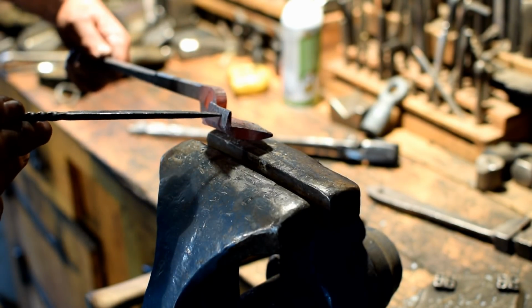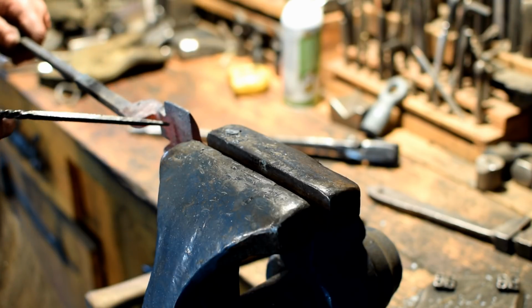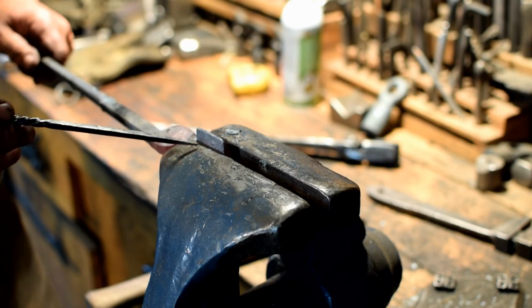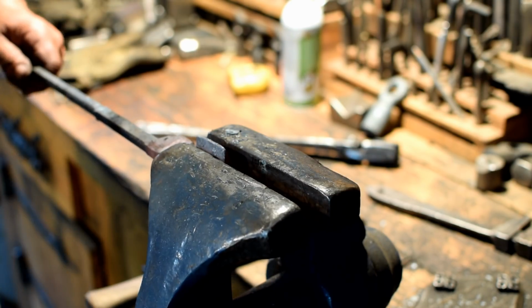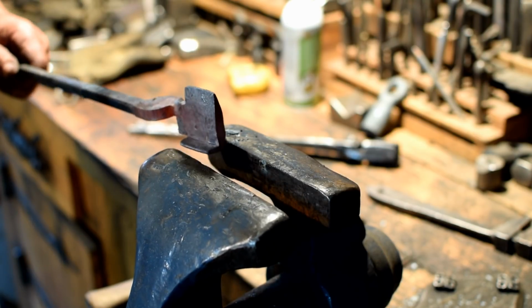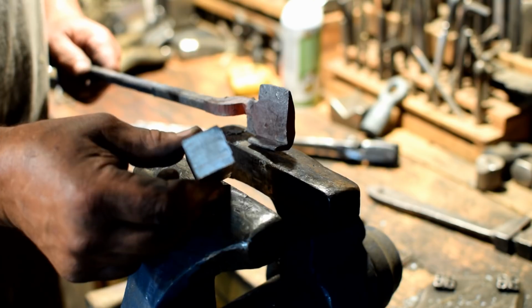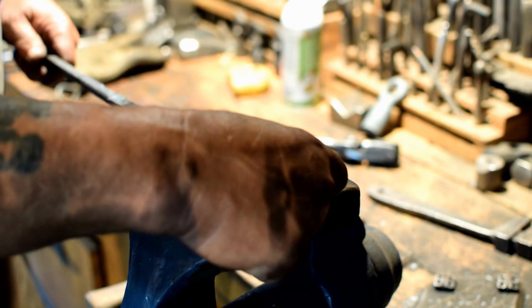We've got our first side bent. Now we need to bend the other side. Now if you've got the right size vise and you're lucky enough, you can slide your jaw blank right in there and bend it over. In our case, we don't have that, so what we're going to need to do is open our jaws up a little bit. I'm going to use a piece of 1 inch square stock that I can grab like this,